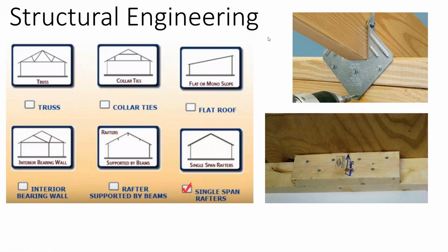It's not commonly done, but you may find, on the right rooftop, if it's an old rooftop and the client is adamant that they want to do the solar array without replacing the roof, maybe reducing the chances that you're going to miss the rafter, only in that one section where you're running the rail across, by going in and giving yourself a little bit more space to lag screw into, could provide a benefit.